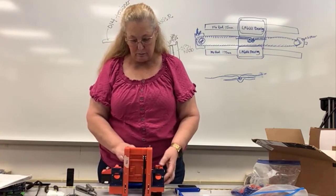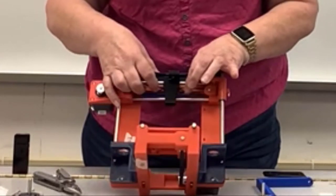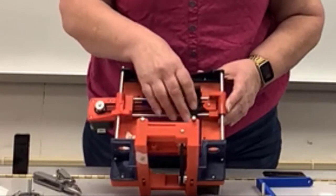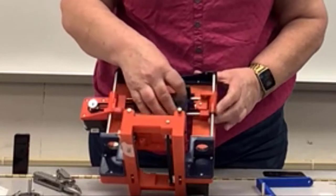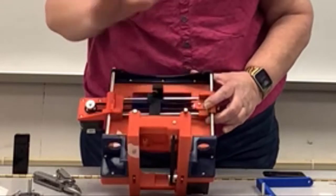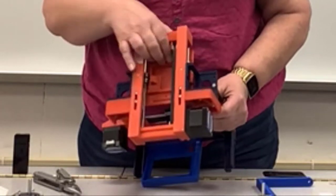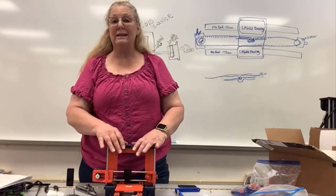This should be sliding smoothly. When we're done with this step, you're going to take the ends of those belts that have a little bit of gap — the leftover edges — and you're going to cut them short so that when it goes to the end it doesn't bang into the ports or hit the gear, which would limit how far it can go back and forth. I'm not ready to cut mine yet. Also, you want to get the belt tight — I still don't have my tensioner all the way tight, so I'm going to adjust that as well.